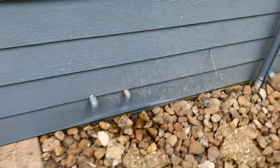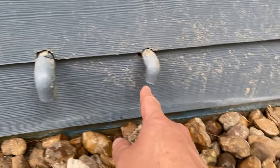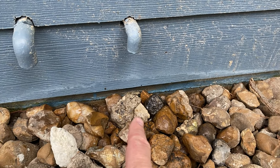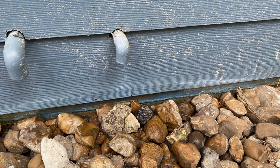Let me take you in for a closer look. Generally, the bigger of the two is going to be your drain pan line, and the smaller of the two is going to be the temperature and pressure relief line. As you can see, we have water dripping pretty consistently from the temperature and pressure relief line — quite a bit of water coming out of that.